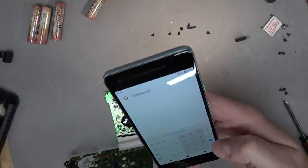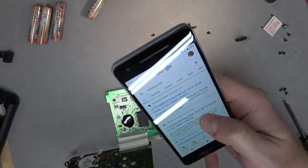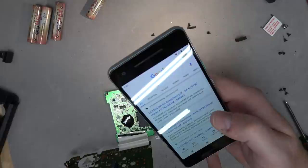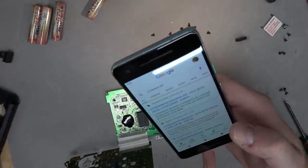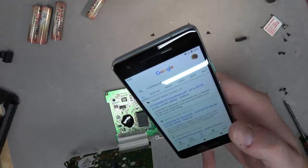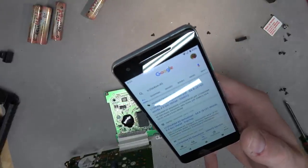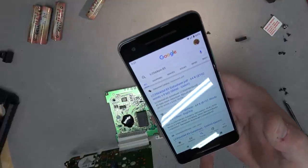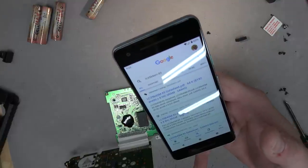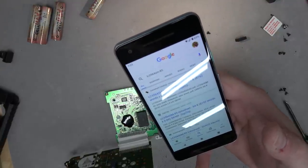Okay, the other chip is the LC3564SM-85. It's probably going to be another RAM chip, probably 8K. Yep, it ends with the 64, which is K bits divided by 8 is K bytes. I might be using that as screen memory, possibly. Or more likely it's being used for work RAM just for the main processes. So I'm going to say it's got 32K of user program RAM and then 8K of operational RAM, which actually isn't a whole lot.